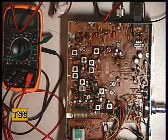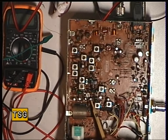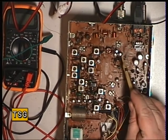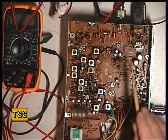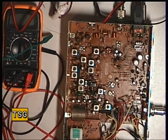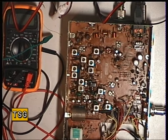The other thing I did during the repair, which I showed you when we were setting up the transmitter, is that I've changed this capacitor and this capacitor. I'll tell you those locations — the 220 microfarad capacitors I've taken out are notorious for failing.